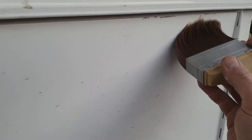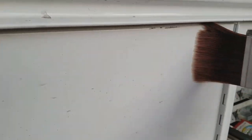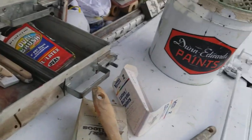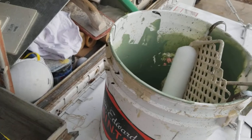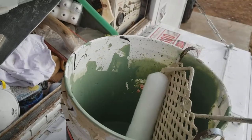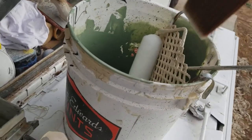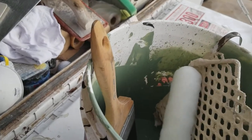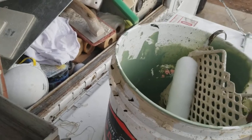Versus doing the weenie roller, if you're going this direction and then flat brushing your last stroke — right before you pull your last stroke, you dip your brush again and put a nice, heavy, fat, light-tipped brush on there, you'll cover a lot better than you will with this. Here are all the things you're doing wrong: you've got a Slim Jim in a bucket and a roller — too many tools in there. You're wasting time because now you've got to hold your brush, and not drop it in the paint, or you're getting paint on your handle, or you're setting it down. I've seen guys setting it here and then dipping, and then flinging paint up on your brush handle, or holding it with your other hand. You've got too many tools in the bucket.